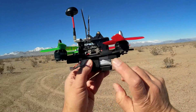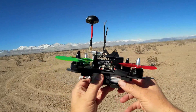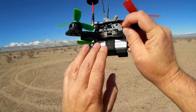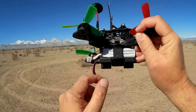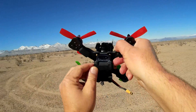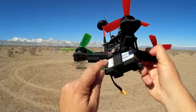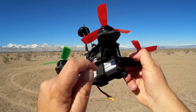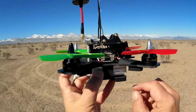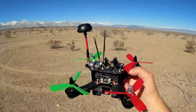It is all powered by an 11.1-volt 3S battery, 1500 mAh. What I like about it is that other X-wings that put the battery on the belly normally have their battery exposed, which can be bad especially if you make a hard landing. This one has the battery somewhat protected with a cushion on the bottom. However, I am a little concerned about the bolts on the bottom protruding into the battery, so I put a little sticky tape in there to provide extra cushioning.